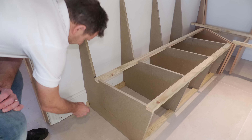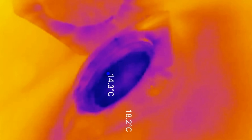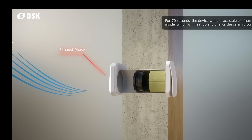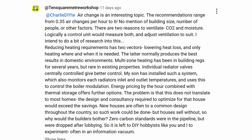My single room heat recovery video is just two weeks old, but whilst I continue to work on the kitchen seating project, some really interesting things have happened since I did this video which I thought justified another quick update today. Firstly, it was pointed out that with that metal duct I'd created a massive cold bridging issue, arguably negating much of the benefits from the heat recovery element. Secondly, there's been a lot of chat about the efficiency of this fan, whether the heat recovery is any good, whether the cost is justified, and what benefits it brings to air quality. I want to thank in particular 10 Square Meter Workshop for all his considerable comments since I posted the video.